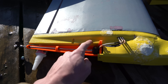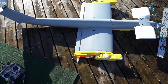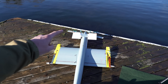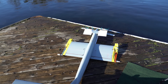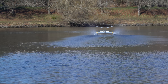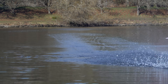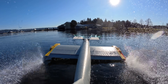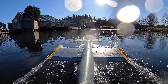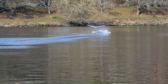For the first test run today, I'm testing the rubber bands in place. I also lowered the maximum PWM for the water motors to 1800 microseconds — basically that's going to make the water motors hit full throttle before the air motors, so we're going to get more power out of the water motors. From the previous video we know this thing works great powered by the air motors, but now I'm adjusting the bias more towards the water motors so they're running at a higher throttle level relative to the air motors. With the air motors attenuated by around 20%, it still seems to work totally fine, if not better.